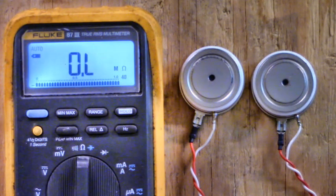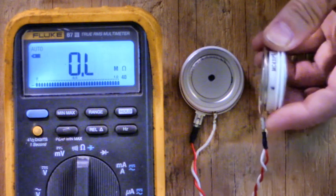Yep, that's my meter lead resistance. So this SCR right here is a dead short. There you go folks. I'm glad you all got to see that, and how to check SCR hockey pucks. They call them hockey pucks because they look just like a hockey puck.